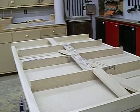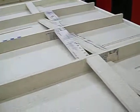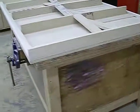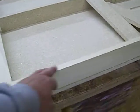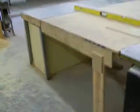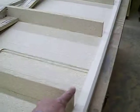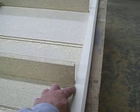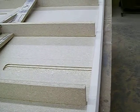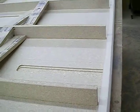And I mentioned I was going to have these pieces here turn it into sort of like a torsion box, and then the poplar, the visible part, is out here and on that far end over there. That's what you're going to see here and on the opposite end. And then the torsion box affair is made up so that the end of them is a 1/4 inch shy of these braces here. This is what sits on the angle iron on the back side of each of the table saw. This one is on the unisaw.